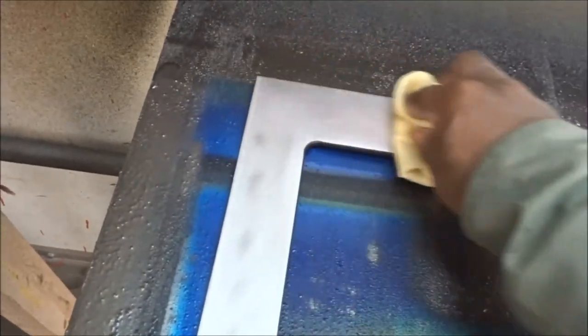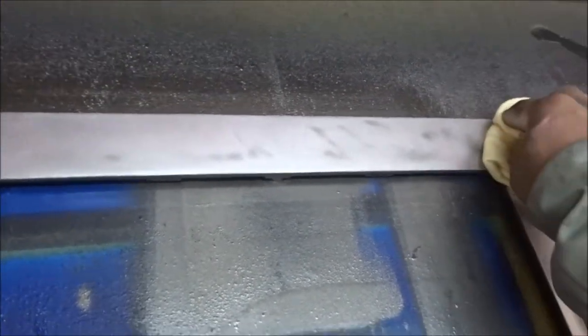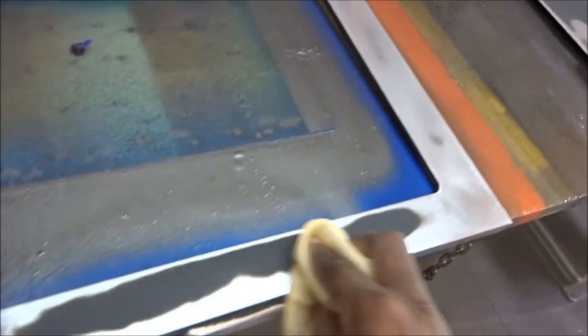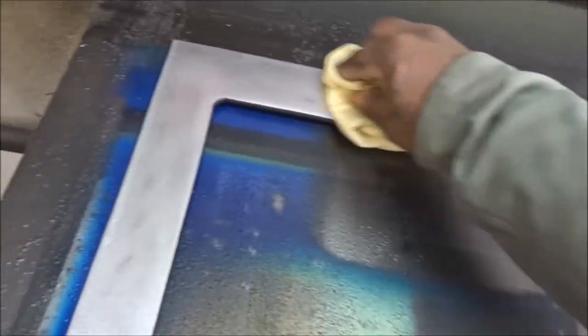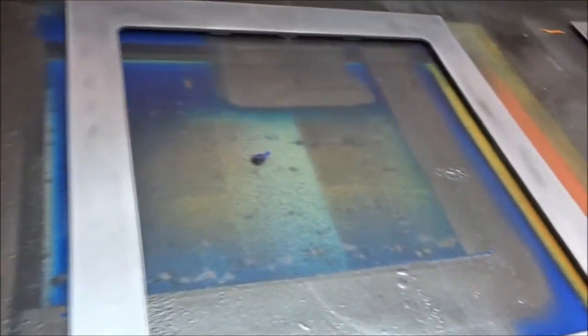You've got to be at least 50 degrees Fahrenheit before you start painting — that's pretty much the minimum temperature. Humidity is high in here because the heater is going, but as the air circulates more, that humidity will go down. Your main concern when painting is temperature. I like to paint around 60 to 63 degrees, but you can get things done between 50 and 55 as long as you have a decent paint area.